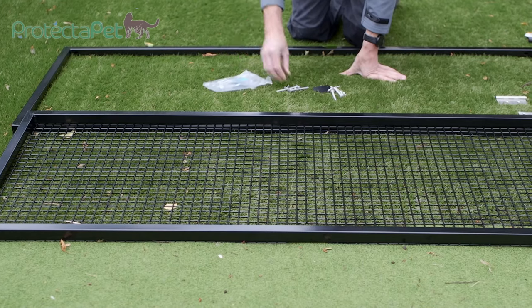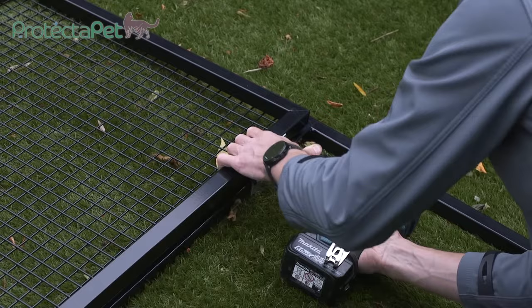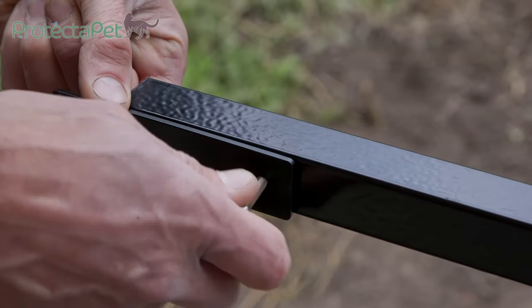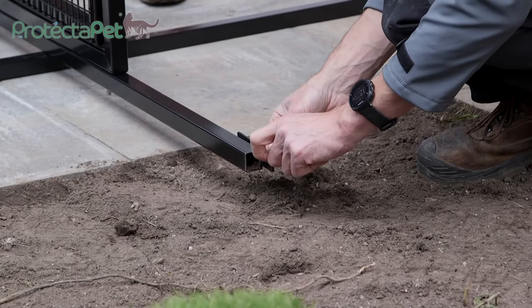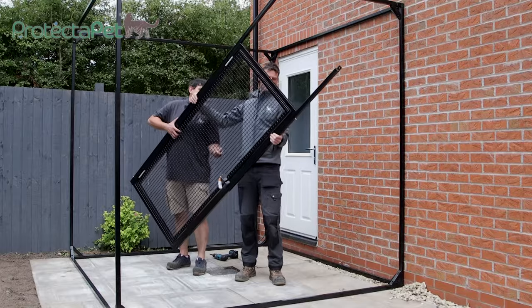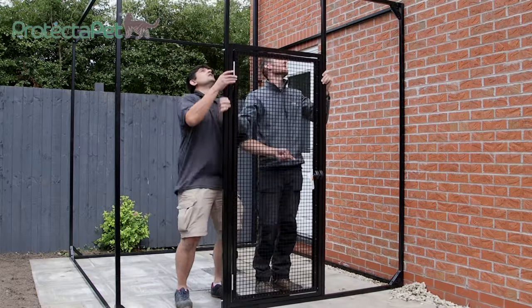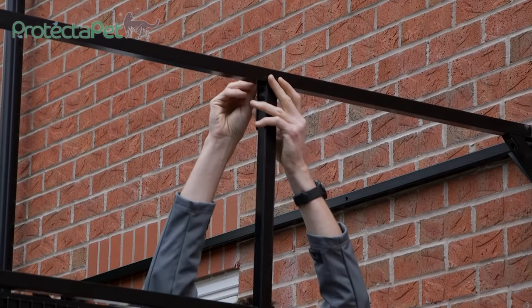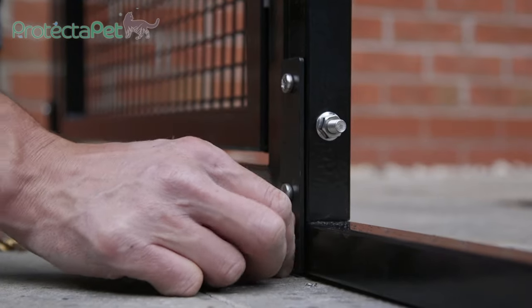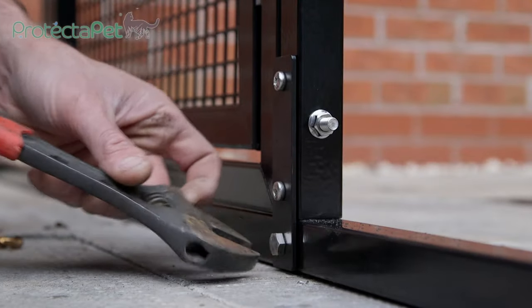If fitting a gate, first assemble the gate using the hinges and latch provided. Attach the gate post to the frame and fit the connector plates to either end of the gate posts with the M6 screws. Use the instructions to assemble the gate and position the gate post so the through holes match. Secure the first gate post by bolting it to the top and bottom horizontal posts. Line up the gate and insert the square cut bolts through the holes in the gate frame and gate post so the dome is on the inside face of the gate frame, then attach the nuts to secure.